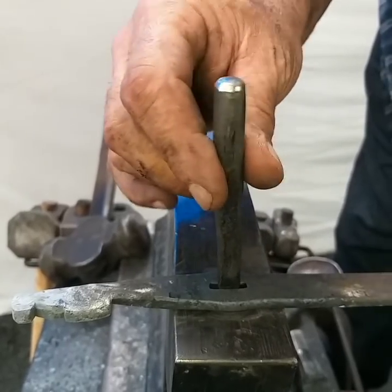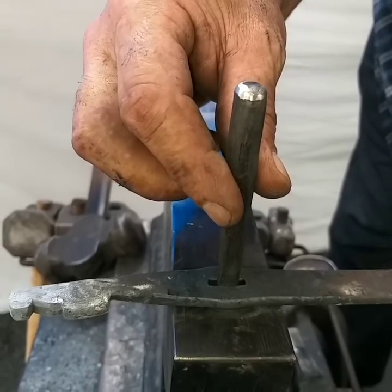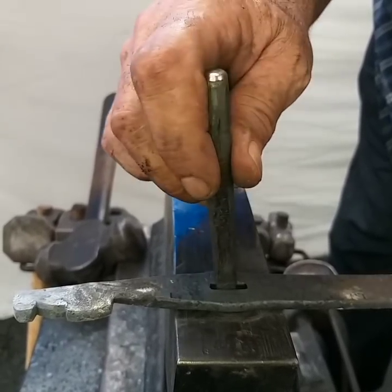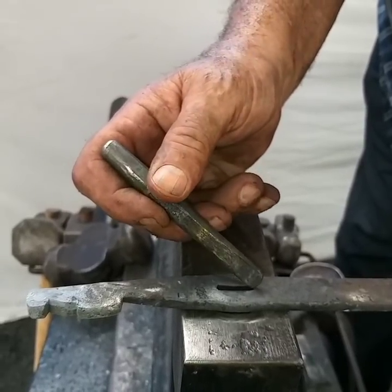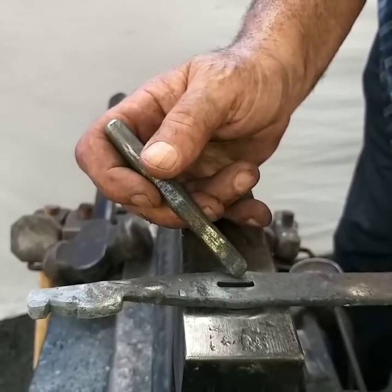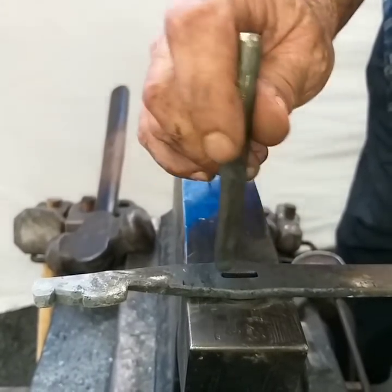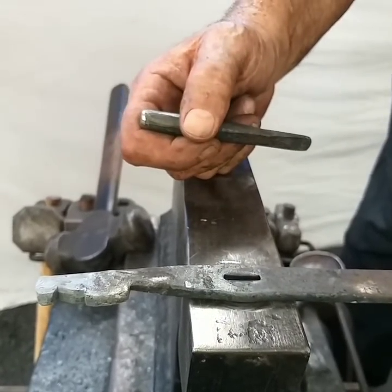You see, if you have an undersized slot opener, what will happen is it pushes the short sides out without stopping on the long axis. If you have one that's the same size, like I've seen done, when it touches here, it kind of tries to stop and doesn't push out here so much. And you'll have to go in one side then the other side. So this allows for it not to touch, and it just acts on these. So it's a lot better.